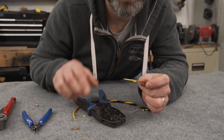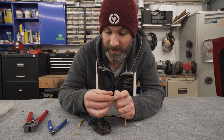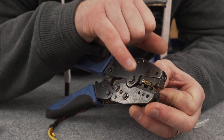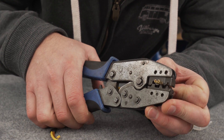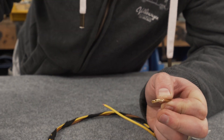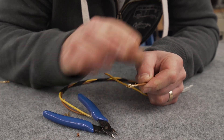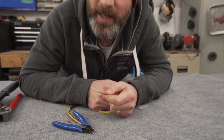Before I put the cable into the crimp I'm just going to add the insulating boot. The cable then fits into the crimp, making sure that the inner core will be crimped nicely by those inner jaws. I will then press home fully on the tool, remove the crimp — and you can see that the outer sheath has been crimped nicely and the inner core has been crimped as well, and there is no chance that is going to come off. All that's left to do is slide the insulating boot over the cable and that is a job done.